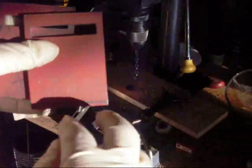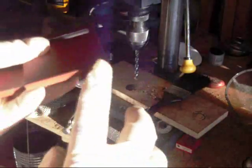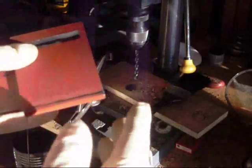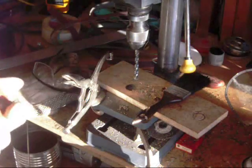Sides are pretty clean. Clean up this side a little bit. I'll be welding the inside and then the two outer edges. I'm not going to weld the bottom because it's going to put a bead there and it'll just make the unit rock. So I'm going to leave that as is. So let me get that set up, and I'll get back with you.